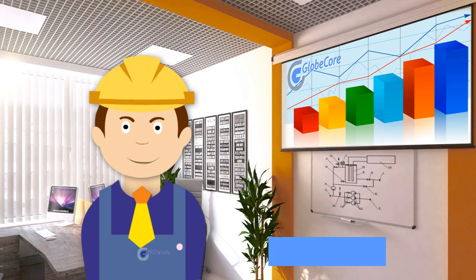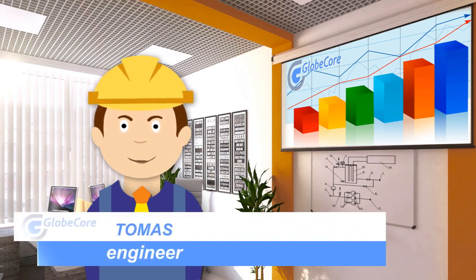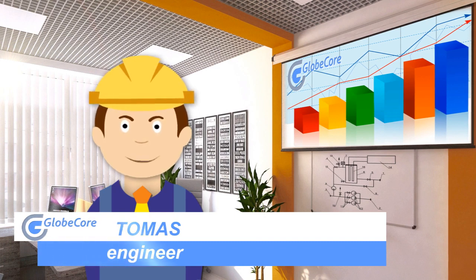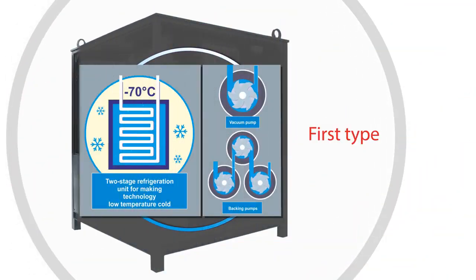Globecore Inei unit. The Inei type units are designed for evacuation and vacuum drying of 110 to 1150 kV power transformer solid insulation in the process of transformer installation, servicing and repairs. Three design types are available for this unit for operator convenience.